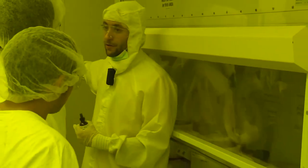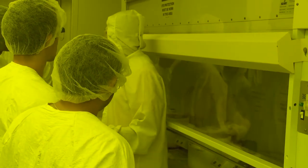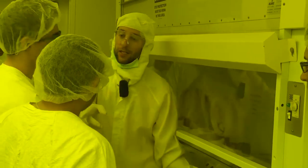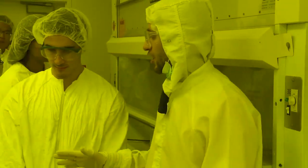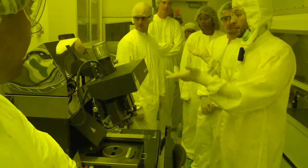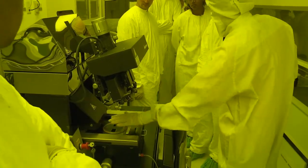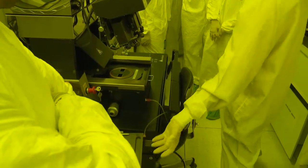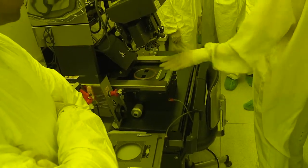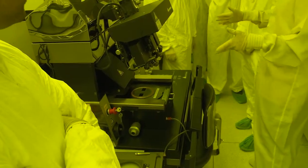Then over there's an oven at 90 degrees C. You put the wafer inside to evaporate some of the solvent it contains, and then in this machine is where you actually create the patterns. It has no secret. Here there's a UV lamp. You put your wafer here, and your mask in this tray, between your wafer and the UV light. You put your mask, and then it's exposed.